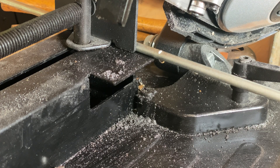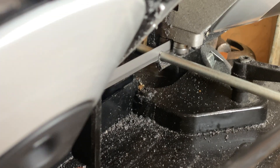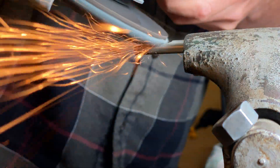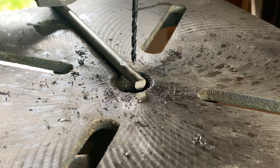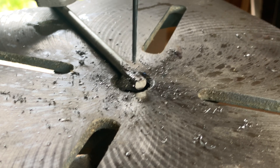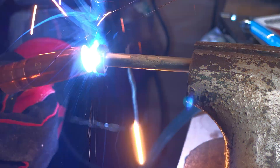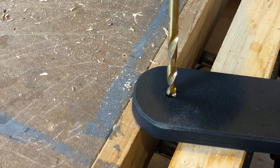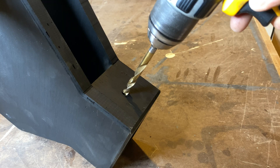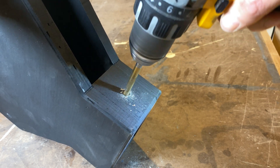All my wood parts are cut, glued, and painted — now I'm moving on to the steel rods used as pivot points for the arms. This is some 5/16th steel I'm cutting on the bandsaw. At one end of each rod I'm grinding a flat so I can more easily drill a hole through it — that's so I can put a linchpin in there to prevent it from sliding out. On the other end I'm just going to weld a nut on. The fit of those rods into the 5/16th holes was tight after painting, so I'm reaming out the holes to get the rods to fit with a little less difficulty.